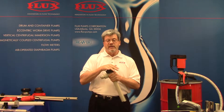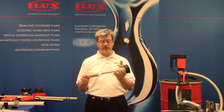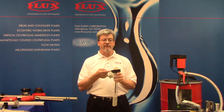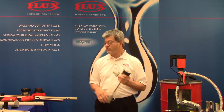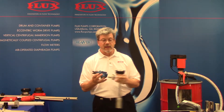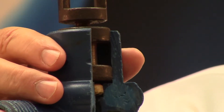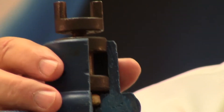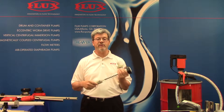The next pump is the 424 — we call it a seal-less pump. There's no mechanical seal or packing, but we do have a radial lip seal to protect the bearings, since bearings are not corrosion resistant and we don't want fumes or liquid getting into them. Here's a competitor's pump showing rusted and corroded bearings — fumes or liquid got past the seal. That can occur from chemical incompatibility. Competitors generally offer only Viton, which is good, but doesn't cover many chemicals — for example, sodium hydroxide or caustic.